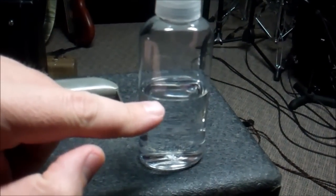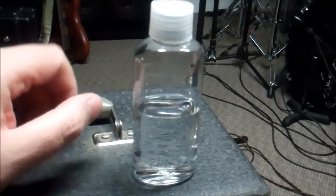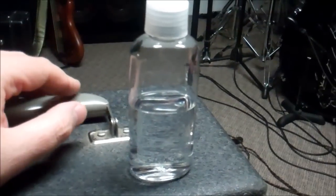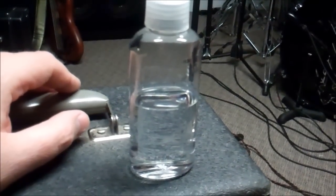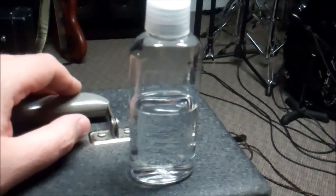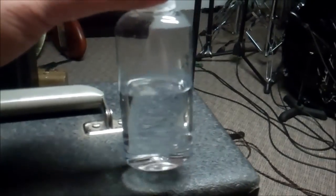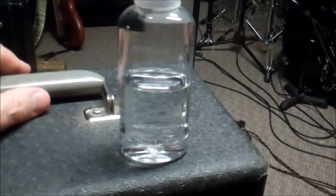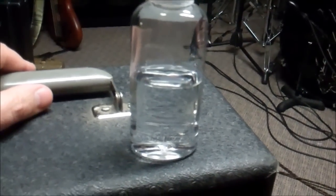Somebody actually found Ray LeBeau and asked him, what a concept. And it turns out the best oil that you can use in these is a Union Carbide product called LB65. You can search for oil for your Tel-Ray on eBay, and you'll find people selling this stuff. It's rumored to be several $100 a gallon, but you can buy a small amount. This is enough to service a number of oil cans, since it only takes a few tablespoons.